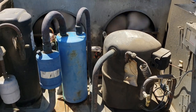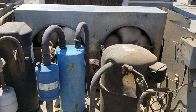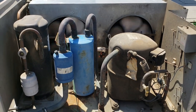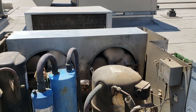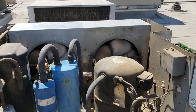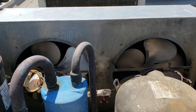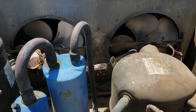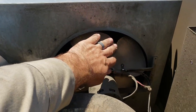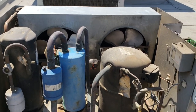We're going to watch this operate for a minute and then look into that condenser fan motor. This looks like it was off on high pressure again. I haven't put my service gauges on yet — I'm going to go get those. But it for sure looks like we're going to have to change a fan motor. What made me think the fan motor was bad: when I spun the left one it spun freely, and the right one stopped really quick. You can turn this off and you'll probably see it — the right one will stop before the left one. You see how it just came to a stop where the left one is still rolling nice and slow. The right one — you spin it again and it just stops. It's just one of those things you tend to notice when a fan motor is going bad.